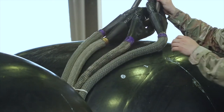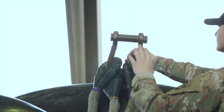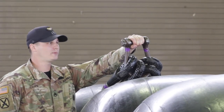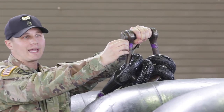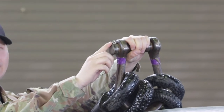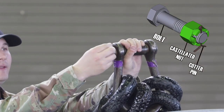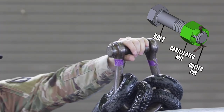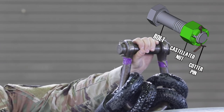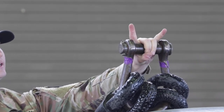You're going to get up here to your apex. Since it said CH-47, I do not need a spacer, so I'm going to put my hand right where that spacer would be. I'm going to check my bolt, castellated nut, and cotter pin. My bolt is here, my castellated nut is facing out or away from the big apex fitting pin, and then it has that cotter pin. Next thing you need to do is check and trace those sling legs to make sure they are routed properly. This is called the phase two gang sign.